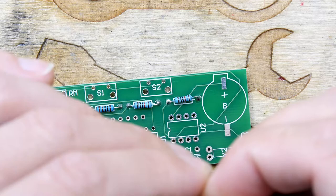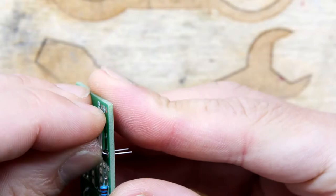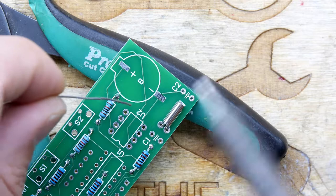How many seconds in a day? Yeah? 24 times 60 times 60. And that'll be kind of a divider that this thing is running at. 24 times 60 by 60, and that's going to be 32,000, whatever that read. I guarantee you. Although it probably might be something more like 10 times faster than that, or 100 times, and then this whole circuit will be doing an internal divider in the microcontroller.